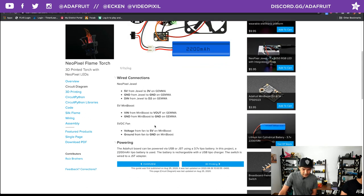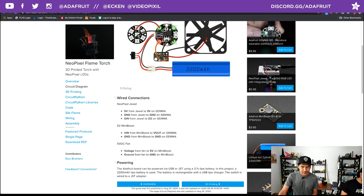I'm using a slide switch JST adapter — just two 2-pin JST connectors that allow you to cut power from the battery to the Gemma. The 3D printing parts surprisingly require no supports for any of this, which is really nice. The coils are all designed for tolerances so you can get nice tight fittings. I have the STLs laid out — they're up on Thingiverse, PrusaPrinters, and I think Cult3D is going to share it too. I also have the Fusion 360 share link, which is a way to download the original source file in lots of different formats, so if you have a different CAD package you can open it up and remix or reuse parts.